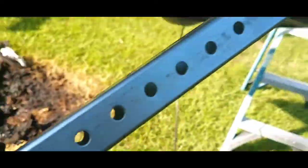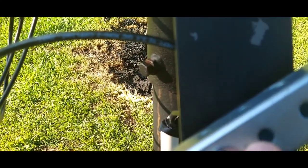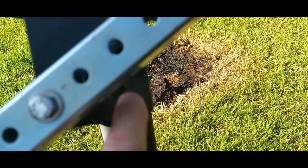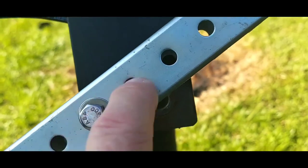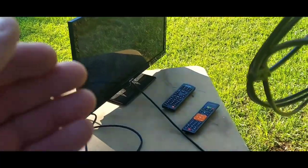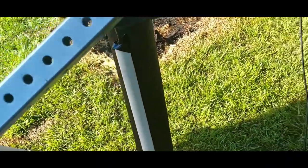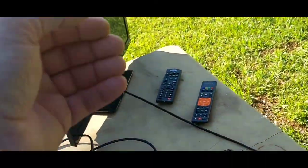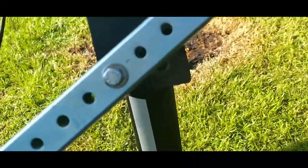I'm still on 103 West. On these bars there's two holes — one here and one here. What I'll do is lower this and put it in this hole, either leave it or go to this other hole. Believe it or not it'll actually line up. Just takes a little patience and I'll make my adjustments. I'm going to go ahead and lock this on 105 West. I'm on 103 now, so I'm going to pull this out and just bump it over. I'll get a picture on 103 and ease it over — when I lose the picture, that's when I lock it down. We're talking about two degrees spacing.